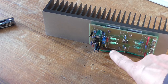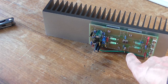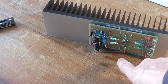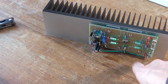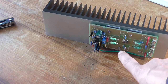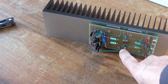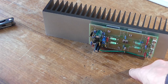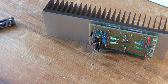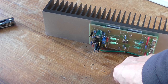The thing is, depending on your supply voltage — I forgot to mention in the assembly video — R7 and R8 need to be calculated for that supply voltage. So if it was plus/minus 42 volts, it's 42 divided by 10, which is 4.2, and then you take it up to the next common value, so in this case 4.7K. If this was plus/minus 35 volts, that would be 3.5, take it up to the nearest value which would be 3.9K. So those two resistors will have to change, because 5 milliamps has to run through the driver stage.